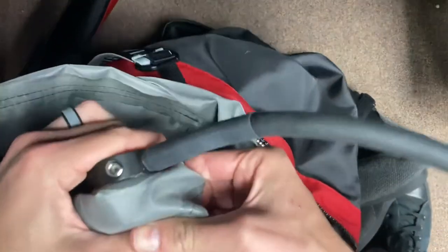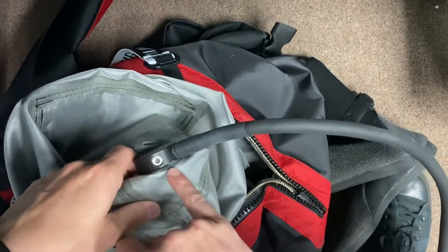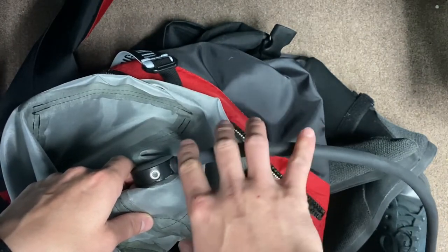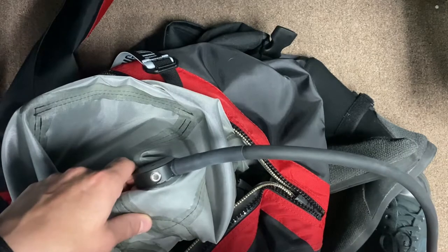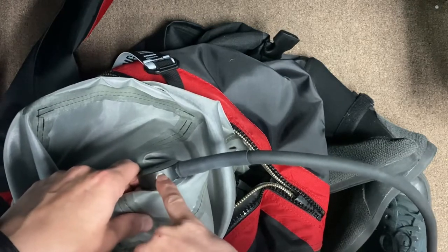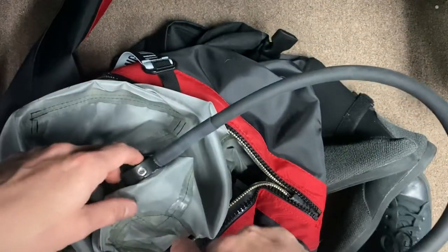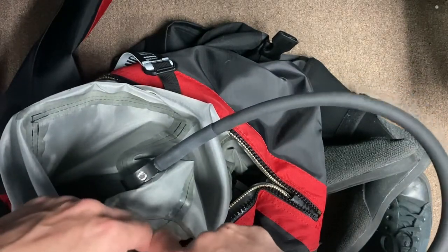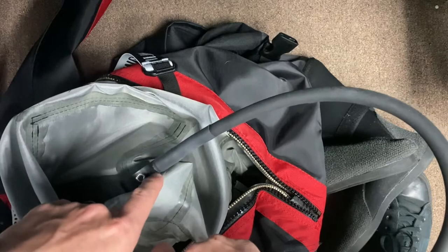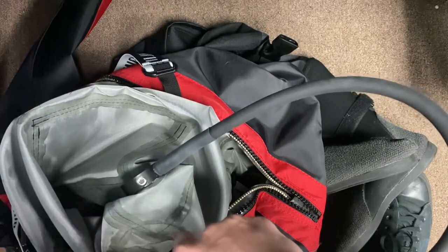So — new duck bill, new flapper, new O-ring. That's all that's going on here. This is our balancing chamber, so it's keeping suit pressure and hose pressure, what's attached to us, all in equilibrium. What I did on mine — I got really annoyed with this component failing, so I actually plugged this off entirely and made it an unbalanced P-valve. I love the nice knob on the tinkle valves, but that is one method you can do to just eliminate some of the working components here. Of course, if you want to go that route, you can always just buy an unbalanced P-valve and be done with that issue altogether.